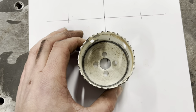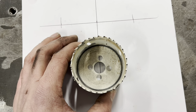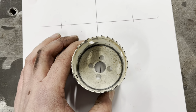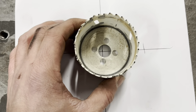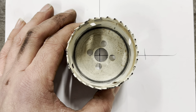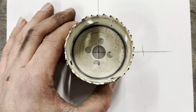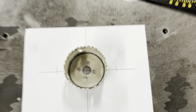That's just the way with these dots, it helps you. Say if you want to get it on the centre of just a line, yeah? Just use the top and bottom one. Bring it over. Bring it over. Yeah? There's the centre. Draw your circle. That's just how you can use these holes to help you centralise your job. Top and bottom, left and right, central. Beautiful. Anyway, that's just a bit of useless information that might be useful to somebody.